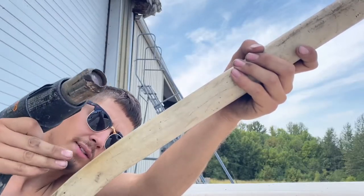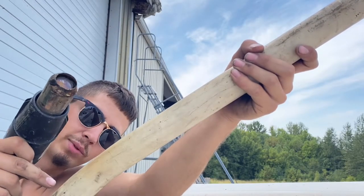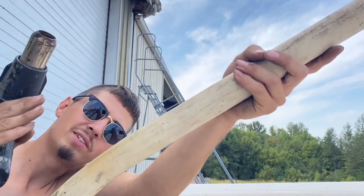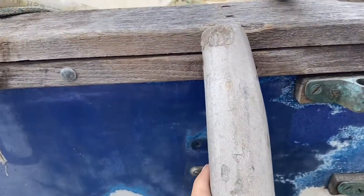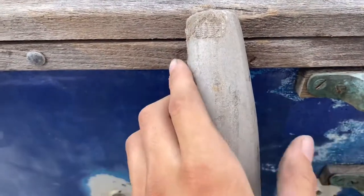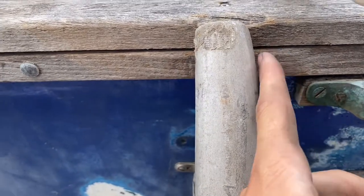We're gonna let it cool and move it down here to get a more consistent arch. I ran into a little bit of a problem — I noticed that when the tiller was straight, the actual rudder was turned a couple degrees. That's because of this arch in how this thing is made. So what I'm going to do is take my grinder and kind of flatten this out to help straighten that tiller out.